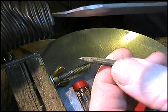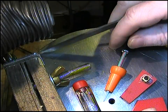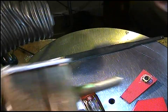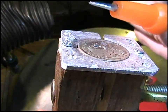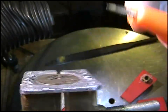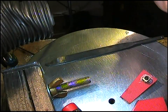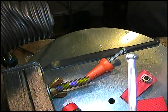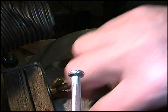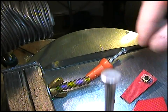These work pretty well because they're not that hard. When you first engrave, you will tend to twist the graver, and that's what will cause the tip to snap. So these being not that hard will actually probably help you as a beginner. Now the template — let me explain. The previous video may have been a bit confusing and I rushed it a bit.